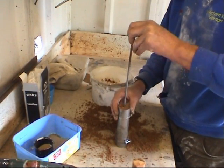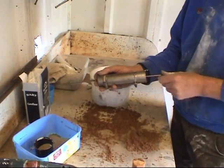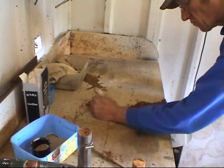A piece of steel rod — I think it's 5mm — is pushed right through the centre of the core and pulled out the other end. Not pushed in and pulled back, pushed all the way through. This helps the core vent as it's being cast.